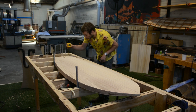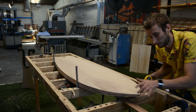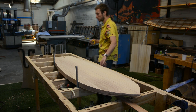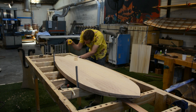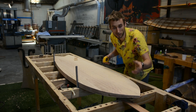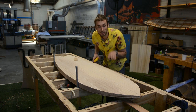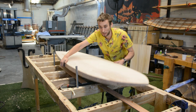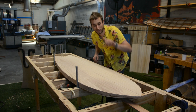The way we determine the width is by measuring the highest point on each end — we've got 70 down that end and 90 on this end, so 100 millimeters gives us 10 millimeters of safety at the highest point. We can go one further by propping up the narrower side of the board to split the difference, so now we're at 80 on both ends. If we rip it into 100 millimeter wide strips we'll have 20 millimeters of safety at either end. The board is propped up 10 millimeters off the surface so when we glue the rails on we get a good overhang on both the top and the bottom.